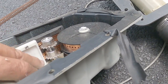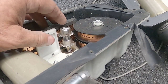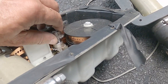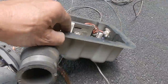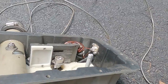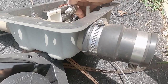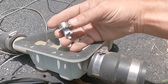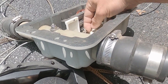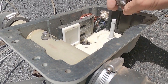Here we're looking at one where that's exactly what happened — it had broken off at the bottom and it won't drive the tapes in or out of the EHU. Here's another one, a driven element from the same antenna, that also had a broken shaft in it. You can see it's completely shattered off the bottom and cracked. These also had a roll pin driven into them instead of having the bolt like the newer ones.